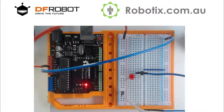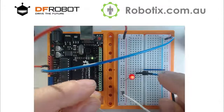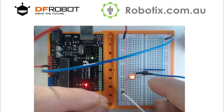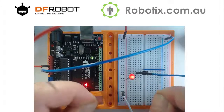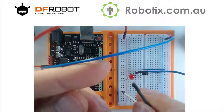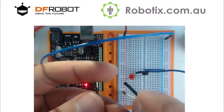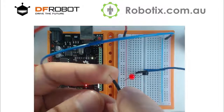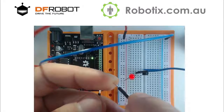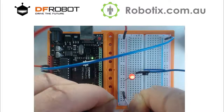If you touch these two wires together, you're going to burn out the LED at the moment. So do not do that. But if you touch them to your fingers, look at that. And you control the brightness on how tightly you hold them. And if both of these guys go into the finger, I'll try to get the view good for you guys. Interesting. You still have to press in. So the very outer layer of your skin is not that conductive. But if you hold tight, there you go.